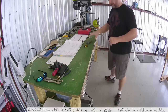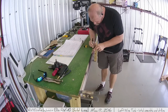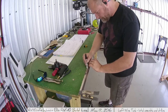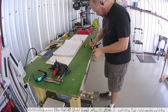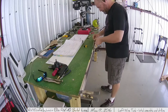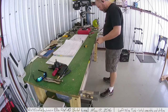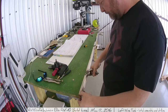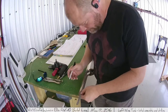Just like the other wing parts, there's a J-stiffener that you've got to get ready to be used. Here I'm clamping it to the table and then drawing the line down the center that will be used to line it up for the various holes when I'm doing the match drilling. This is something you end up doing quite a bit on all the parts — I've done it on the wing and on the empennage. Nothing hard, nothing magical — just marking some dots, drawing some lines, and making sure it's legible and clean.